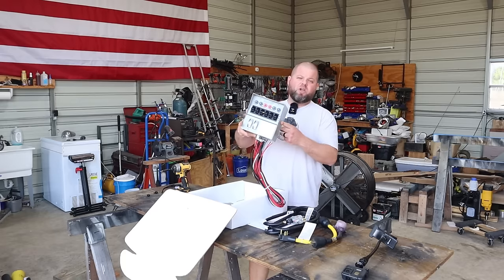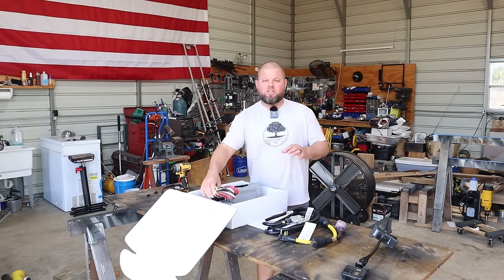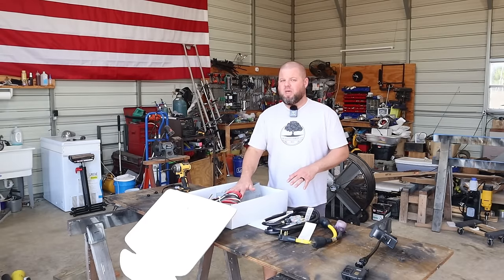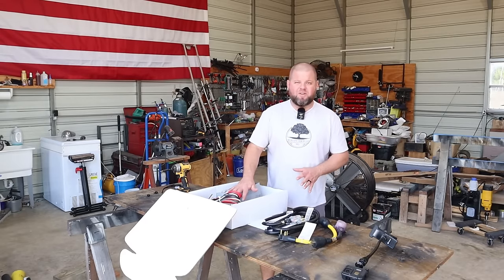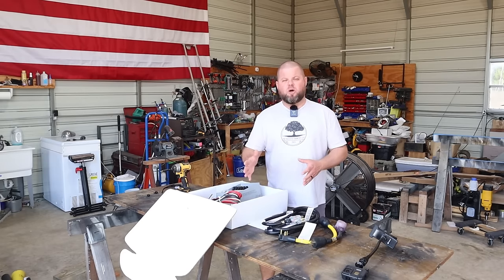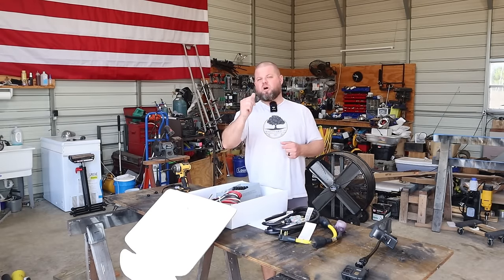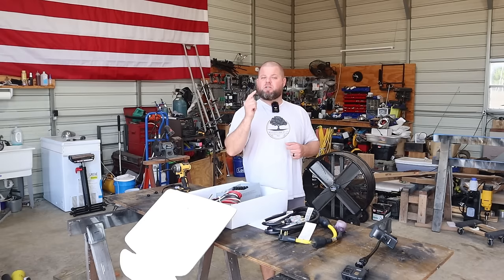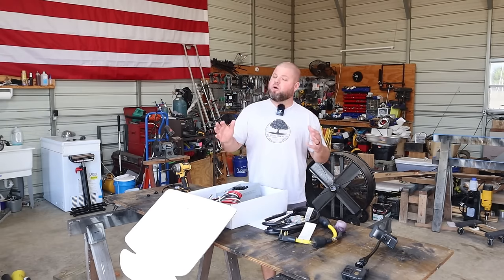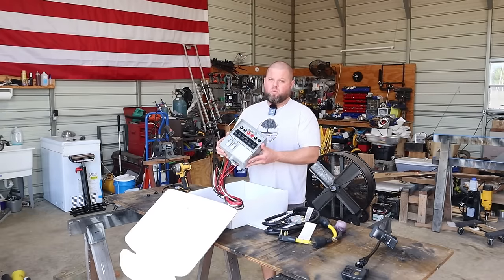In today's video, we're going to cover installing a generator transfer switch. Now I want to let y'all know, in this episode, not only are we going to cover generator transfer switch hookup, but there's a ton of poorly done videos I've seen online, and most do not cover 110 volt hookup. What if you have a 110 volt generator? So we're going to cover hooking up to a 110 volt generator today, as well as a solar powered generator. And we're going to go over the basics for hooking up to a 240 volt generator. The good news is you can do both with one box.